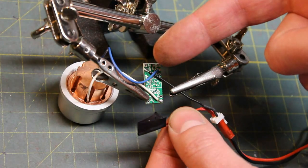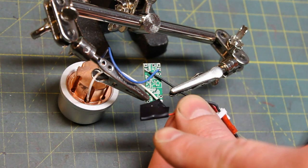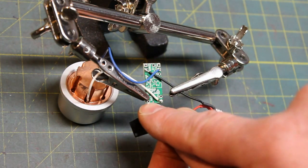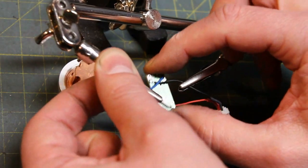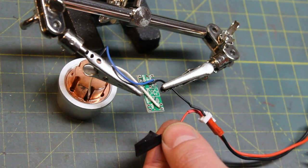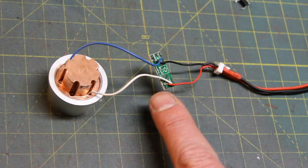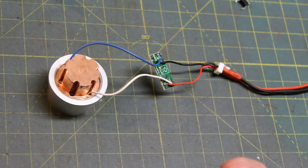I've attached the black wire to ground first — that's always best practice. I've still got the red wire insulated, so now I'll pull off the tape and attach the red wire to the positive voltage-in pad, being careful about where I clip to avoid short-circuiting anything. So now I've got my LED wires on voltage out and ground, and my battery wires on voltage in and ground — and all grounds are connected.